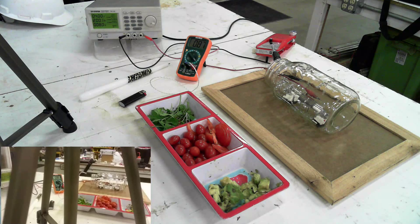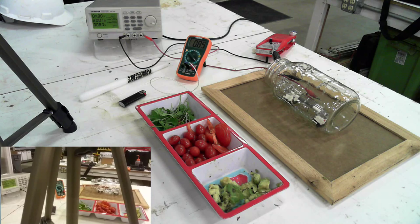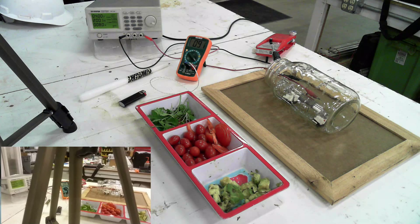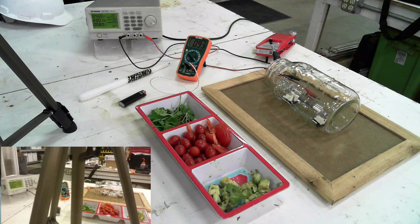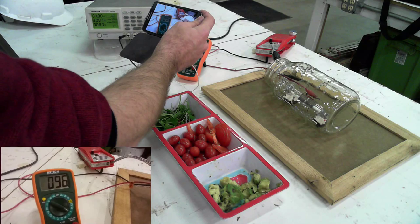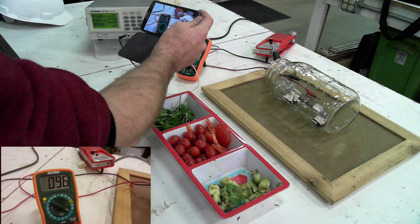Okay, so when it hits about 120, that's when the lithium aluminium hydride might start to decompose. That's right, that's about the temperature we saw when we previously did the experiment. Now my point was, we could approach it a little slower if we want. If there was a little bit of dust on the wire itself from the loading process, it would see the heat much faster than the thermocouple. Yes, there probably would be a tiny trace amount of dust. And it would break down much sooner.